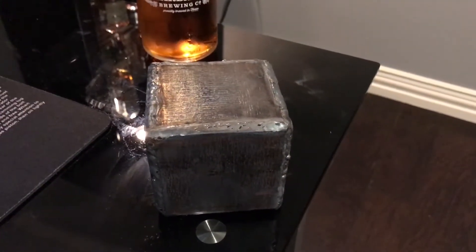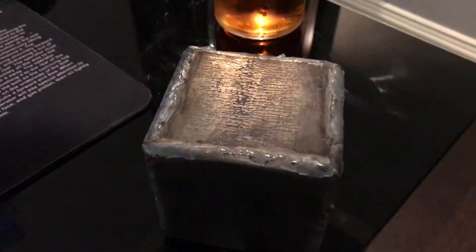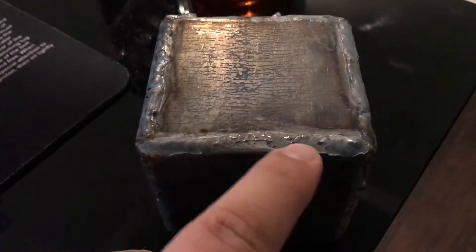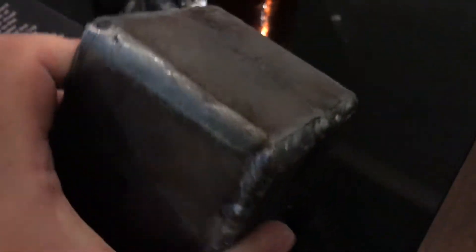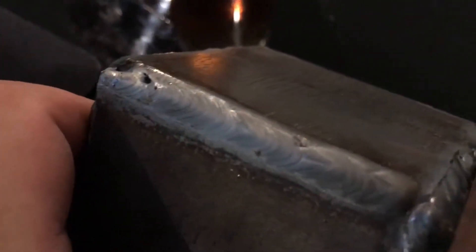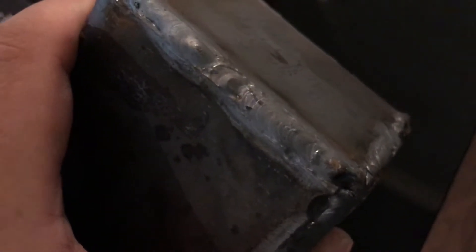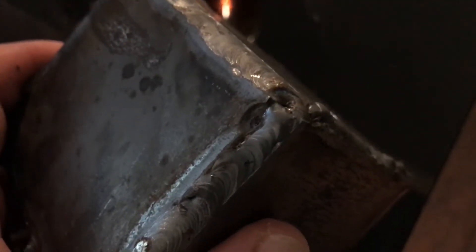The key finally cooled down and I was able to check it out. This is probably the best one I've made so far. The welds still aren't perfect — some porosity and some boogers where I was trying to fill some of the holes. But there are also a few decent welds; minus the holes again, that looked good for a while. Another little hole. I think that's really just my prep because I'm just testing with this metal. I'm not really doing a good job prepping, but I think maybe I should, just so I don't get all of this kind of crap where it just blows out.